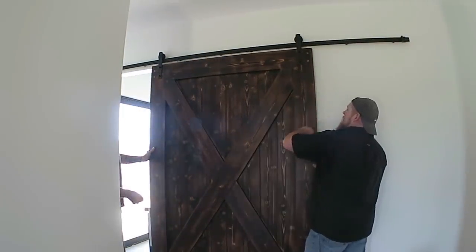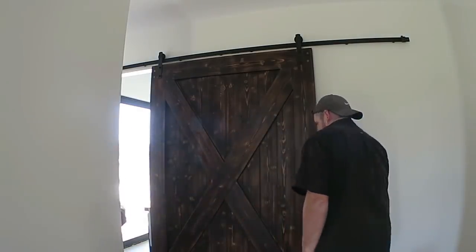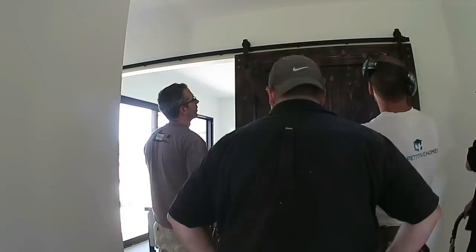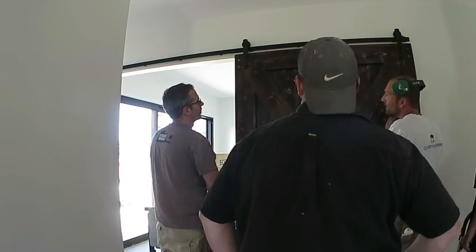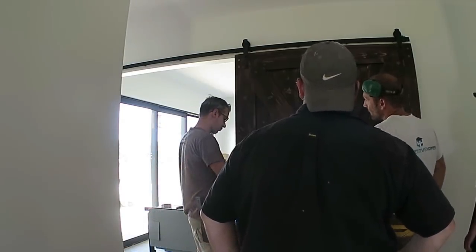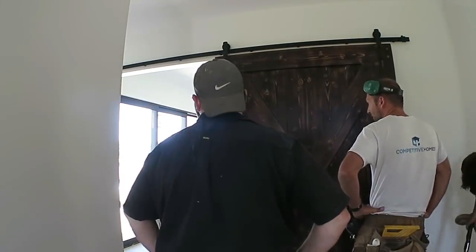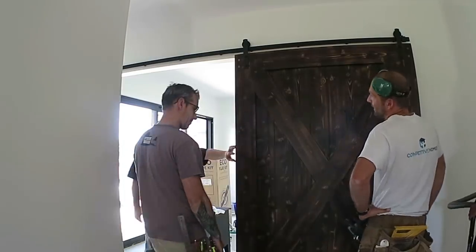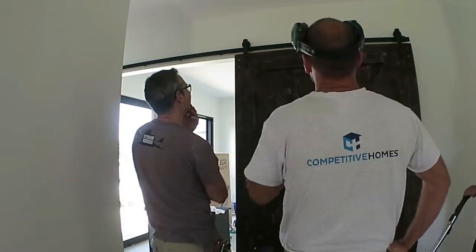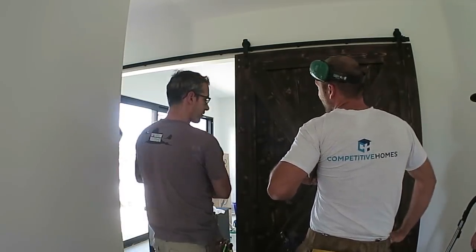Jammed on the floor. So floor that out. The floor's fine. It seemed that the floor had a 12mm hump right where we didn't want it to be. You couldn't actually notice it at all when you're walking around, but the door told the story. So after much conversing, I decided just to cut the bottom of the door.